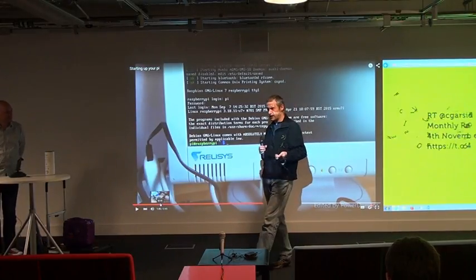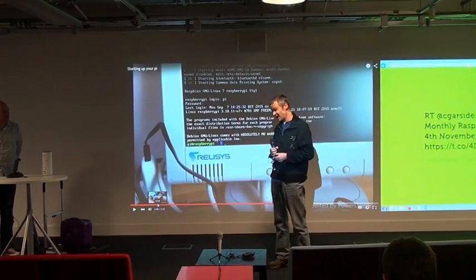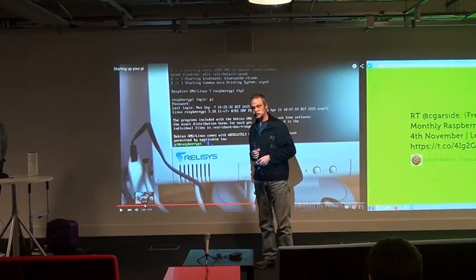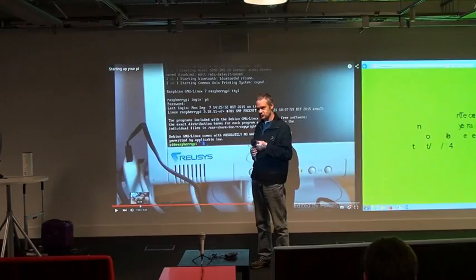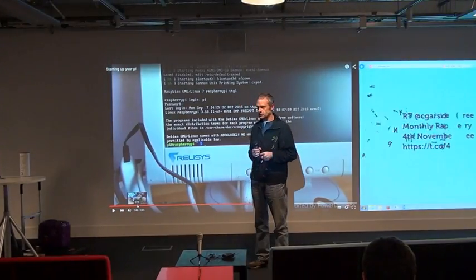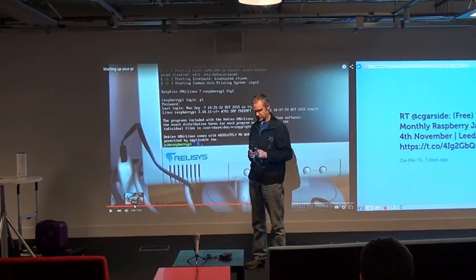The ones for mobile phones are great — they work for a normal Pi. I've got a Pi with me which also powers the screen. It kind of just about works, but I normally use a more powerful power supply. You can look on CPC or any of the online websites. The crucial thing to look at is the rating in milliamps: you want it to be 1200, 1500, or 2000 milliamps, or in amps.